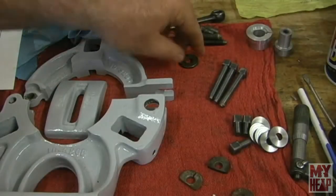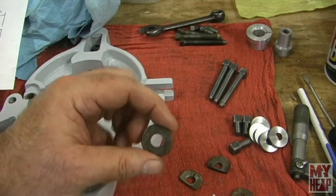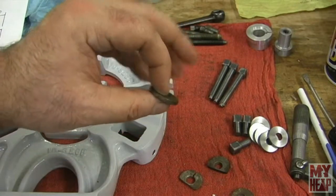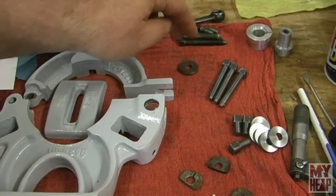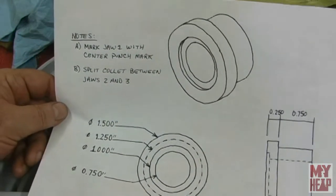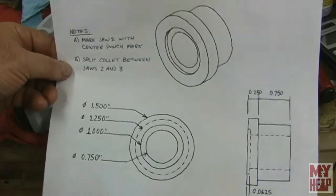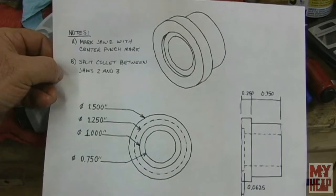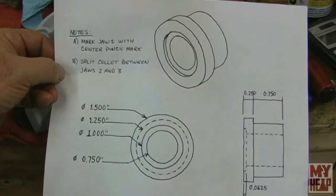But now I need another one for these here, because these are 1-inch OD washers and 3/8 ID, or clearance hole for 3/8. They're about 1/8 inch thick, actually a little more, maybe 130 thou or so thick, and they got a bevel on the top as a finished washer. So I thought I would go ahead and see if I can get that in frame. Do a little drawing here of what this looks like. And of course, the printed lines I felt were too light, so I sort of hand drew over these. So if it's a little sloppy, please forgive me.